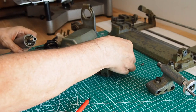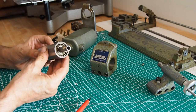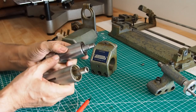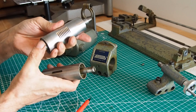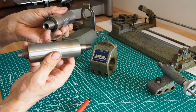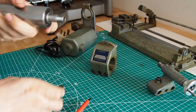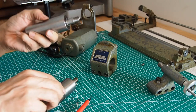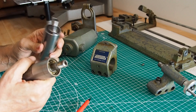The spindle is out. There were comments last week about the surprise that there was a lack of keyway on here. I couldn't quite reconcile it, but I have the collet or watchmaker spindle for the SL — they're identical except for the collets. The WW collets fit in there and the chucks screw onto this one, but this one has a key on it and the other one doesn't.